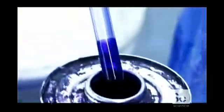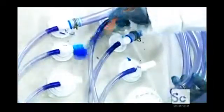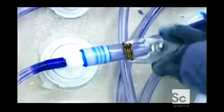Next, they dip PVC tubing in adhesive and attach it to the jets, weaving an elaborate web of hoses. The narrower tubing will pipe air to the jets, while the wider hoses will supply water. To prevent leaks, they equip them with self-tensioning clamps.